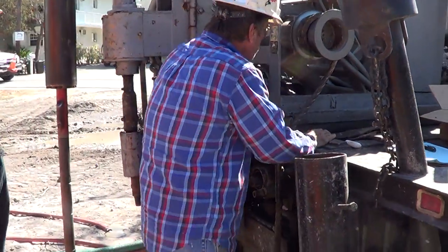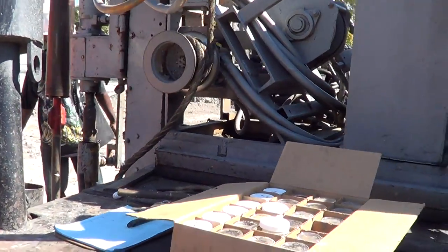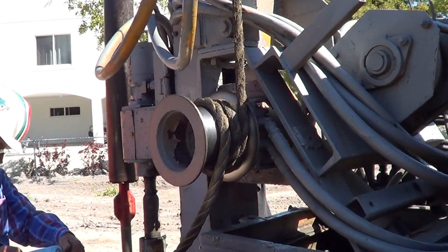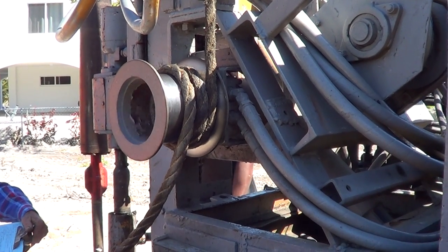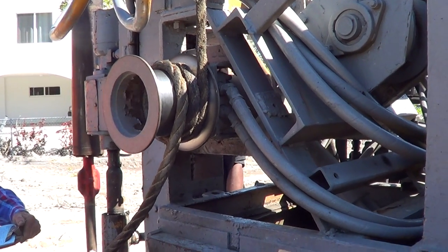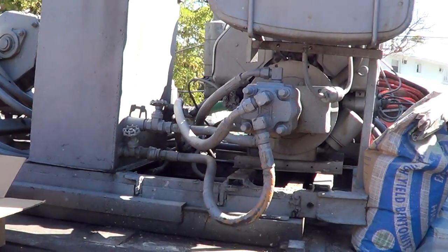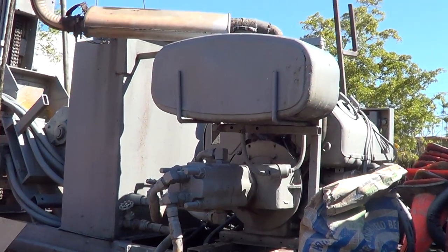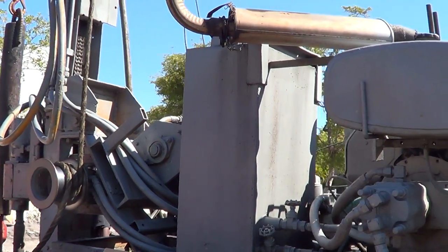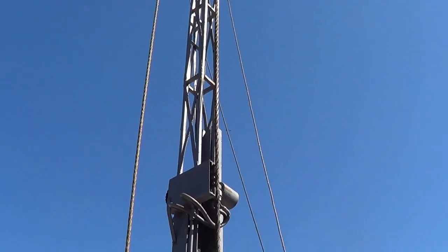They'll never come up with a better option. This is very dangerous work because if you get your hand stuck inside of that clutch, it's not going to stop because your hand is in there. When you're not pulling onto the rope, the clutch is off — it's like a clutch, it's a friction thing. Basically everything works like a friction. This is the motor — a little diesel motor that operates the hydraulic pump. This is the tank for the fluid for the hydraulics, and this is the stick or the boom, and this boom is about 20 to 21 feet high.